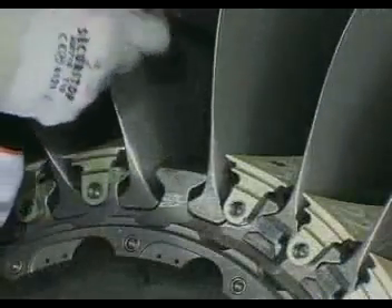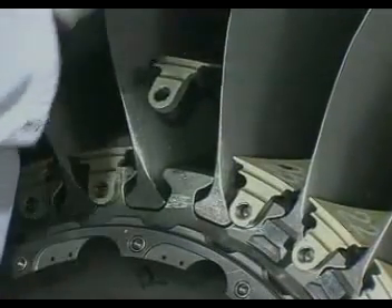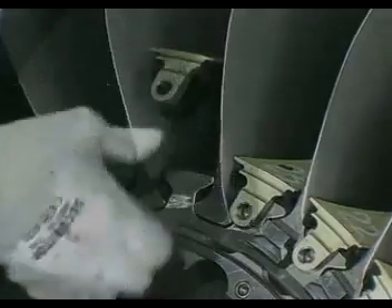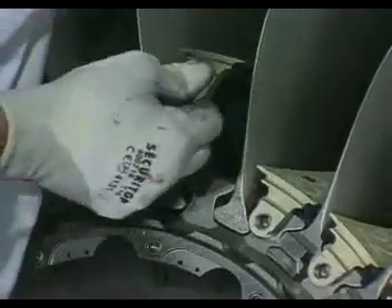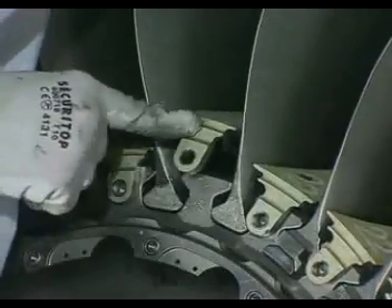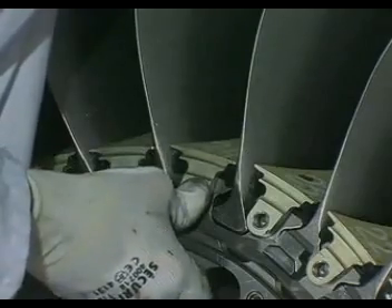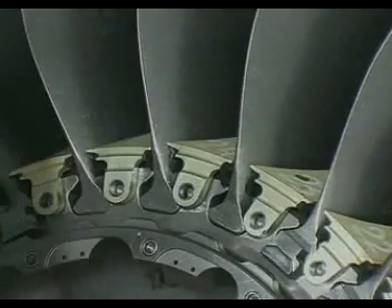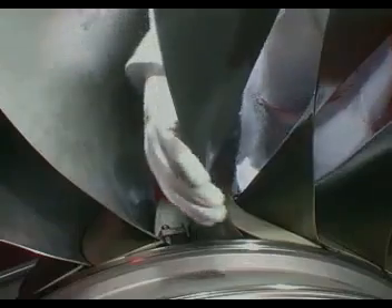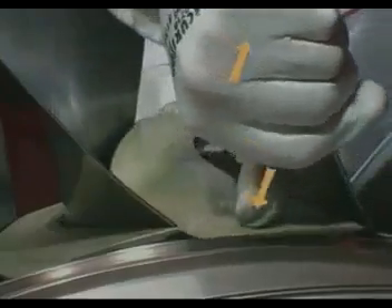Repeat the process to engage the last platform. Note the position of the fan blade dovetail at the front, making sure that the blade root engages in the slot of the booster spool forward flange. Push the platform horizontally with your thumb. You must feel when the rear pin engages the rear swaged bushing. If not, the platform will not engage in the final position. Here you can see how you guide the rear of the platform with the thumb of your left hand.